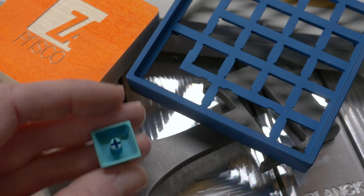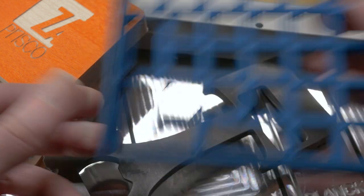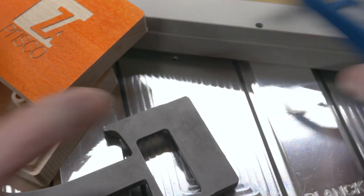All that's not to say this is a bad machine. It's a little prototyping, hobby, low-production machine — it is what it is. It costs a fraction of what the big machines cost, it's cheap and easy to repair, and it will get the job done. It's just a matter of how fast it gets that job done and what compromises you need to make — things like post-processing, cleaning up finishes, stuff you might not have to do on an Okuma or a Mori Seiki. I've made plenty of stuff I'm proud of with it: parts in aluminum, steel, and titanium. There's nothing I've found that it can't handle; you just need to be mindful of its limitations and program around them.